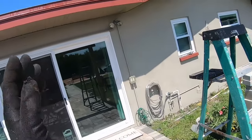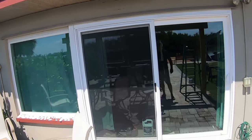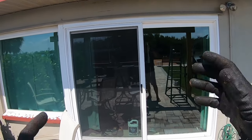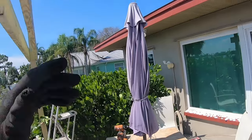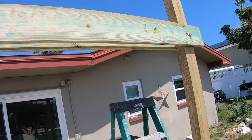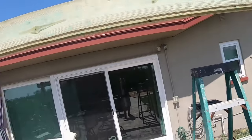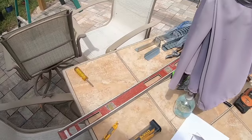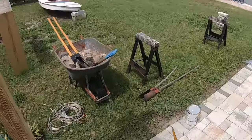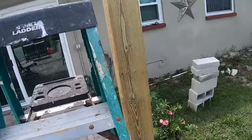I got joist hangers. They're galvanized steel. This is a block house, so they'll screw into the block, and then you set the joist in and put some screws in to hold it in place, and then they will sit on top here. I'll space them out accordingly, and I have twist brackets which will hold those in place, and those will come out to about here, and I'll cut the ends just like I'm going to do the ends over here as well. So this is a reciprocating saw, and we're going to see if I can get this without making a mess of it.